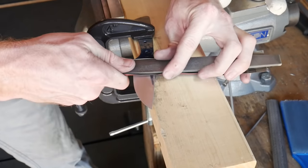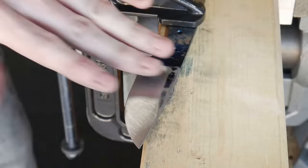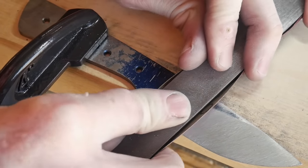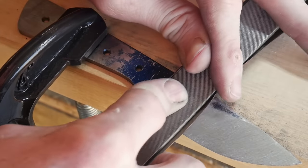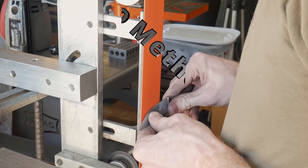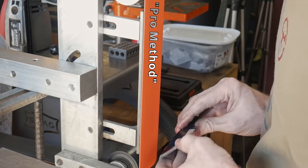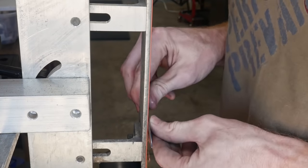When you're getting close to your final height, I like putting a piece of 120-grit sandpaper around my file to start blending in the plunge line area with the flats of the bevel. The pro option when beveling is to use a grinder with a flat platen or a wheel; however, using the files and sandpaper can give you the same results if you have time and patience.